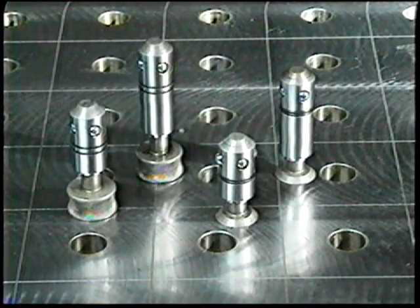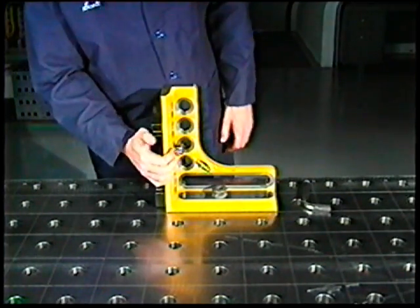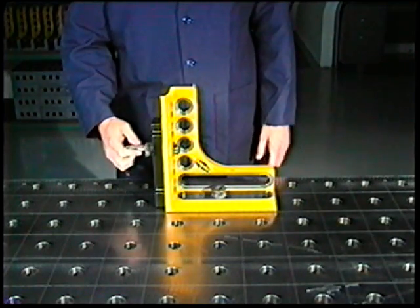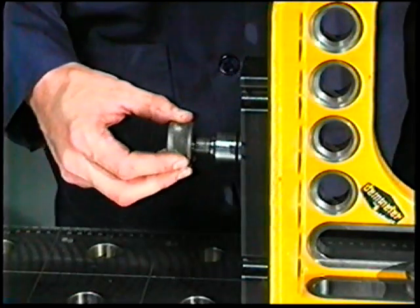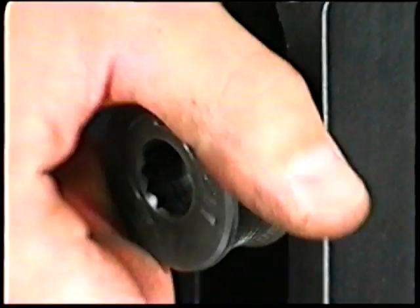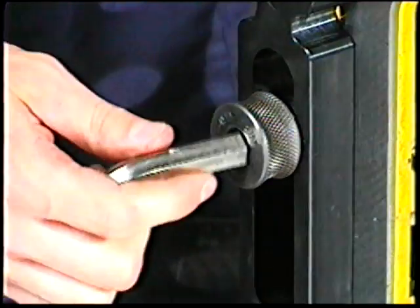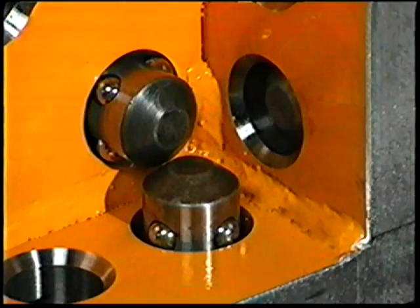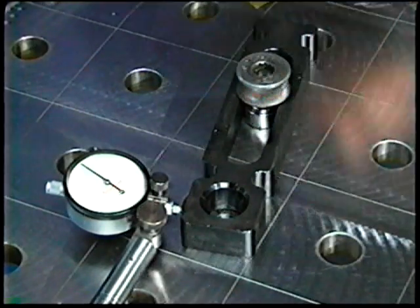The cornerstone of modular setups is the patented PC bolts. They are the connecting elements between the table and all other items such as angles, supports, stops, and spacer blocks. They are designed to be quick-acting and yet deliver a high clamping force. An integral O-ring cleans the system bore, makes the bolt self-centering, and allows for one-hand operation by preventing the bolt from rotating during tightening and loosening. The knurled head is turned to tighten the PC bolt, driving four balls out into the chamfer on the back side. A simple pull on a hex wrench generates 6,000 pounds of clamping force. The tapered end allows three PC bolts to be used in a corner without interference. The PC bolt can be tightened without moving the part it is holding.